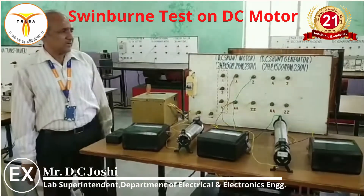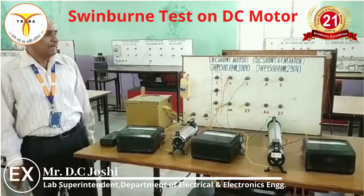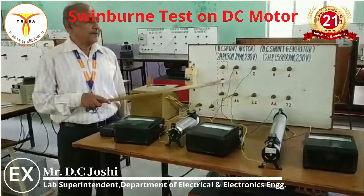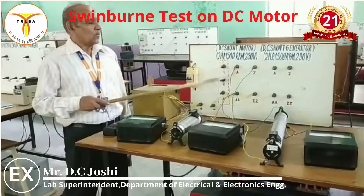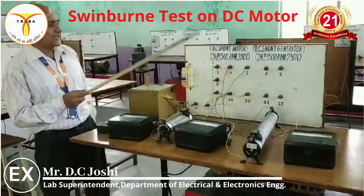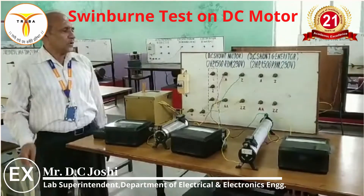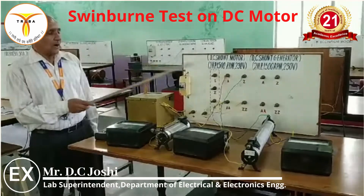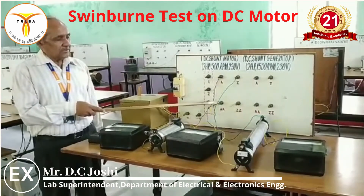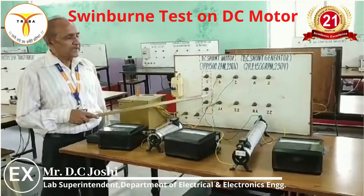In the motor, IA equals IL minus ISH, so we can find IL. P0 equals V times IL, so IL equals P0 divided by V. The approximate efficiency at full load is 85%, so IL equals (P0 / V) divided by 0.85. Now we can find IL squared times RA, which gives the total variable losses at full load. The total losses are WC plus IL squared RA.